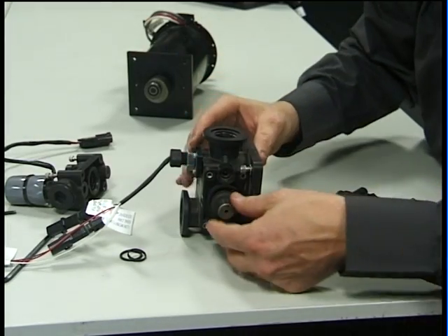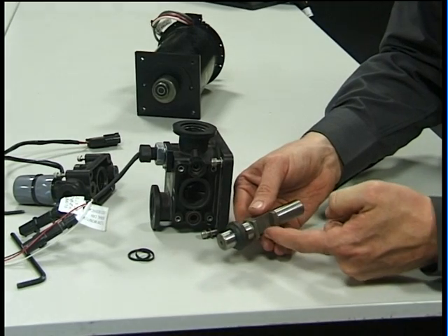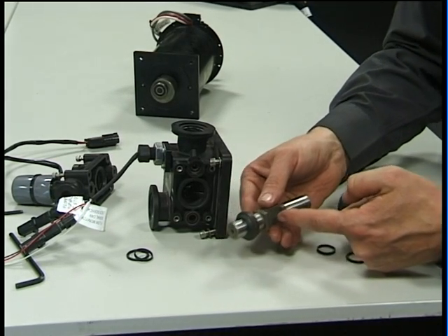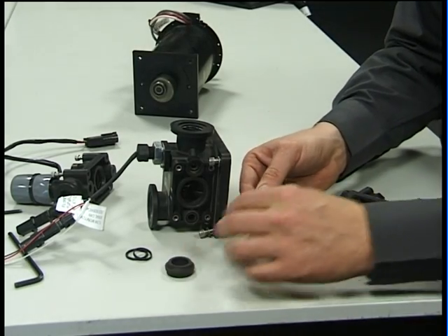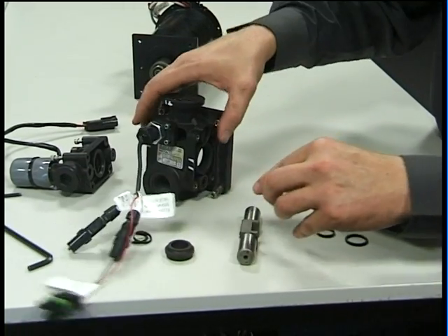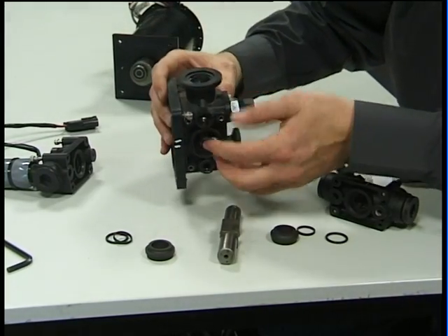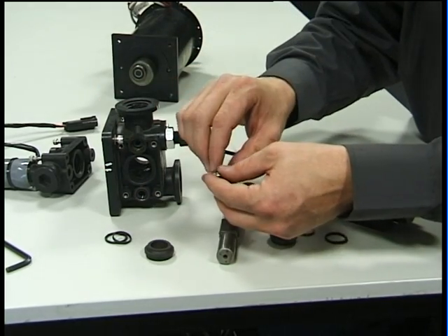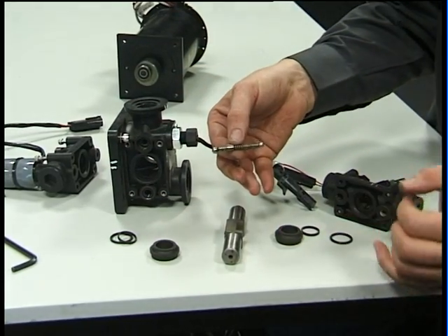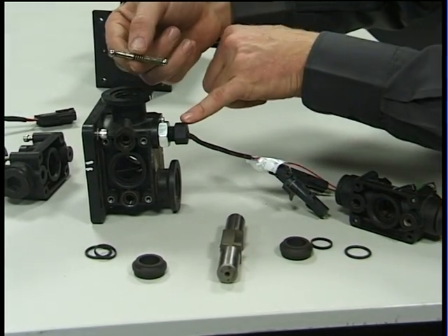The pumping element is made up of a main plunger which is connected to the ball bearing on the wing on the cam to move it backwards and forwards, and it has some gland housings either end. Also in the pumping element housing is the shuttle valve which activates the flow switch via the magnets on either end passing past the flow switch.